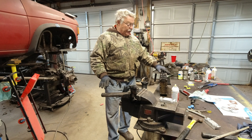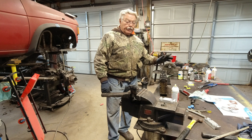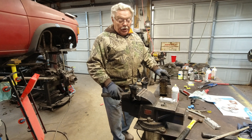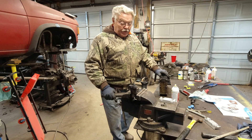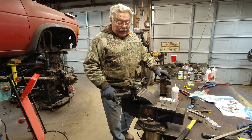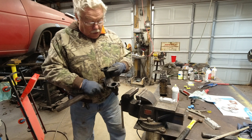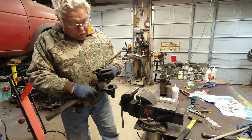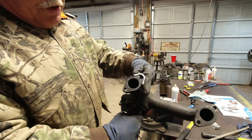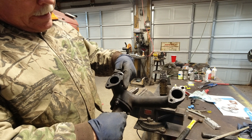We're back on the Perkins 3152 repair. We've diagnosed low compression on one cylinder — the head had a weld in it, it's cracked, and the valve seat is bad. So we elected to replace the head. One thing that's pretty commonplace: lots of times you'll unbolt these manifolds and find cracked ears. This is an exhaust manifold here in the vise, and I'll show you how to make a repair on these when you don't have a replacement. Of course you can order one, but you can make a pretty nifty repair. I'm going to weld this up, put a washer over the top of it, and this will be good as new.